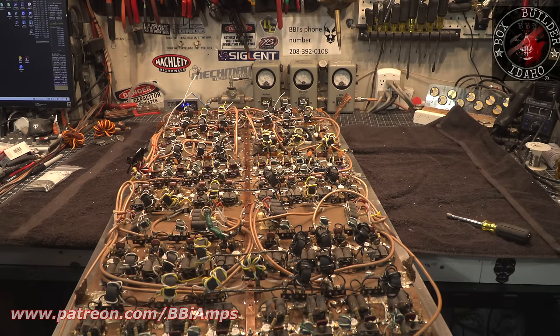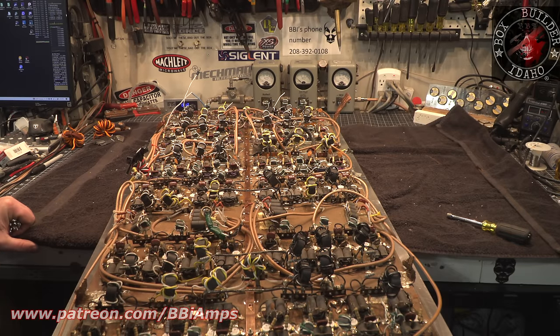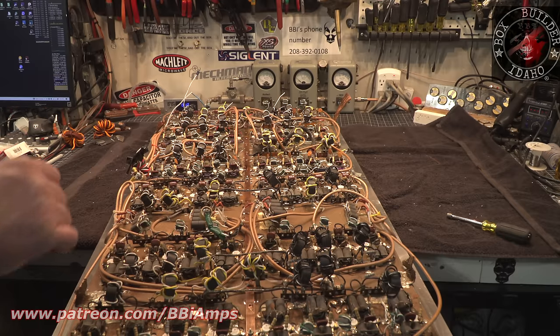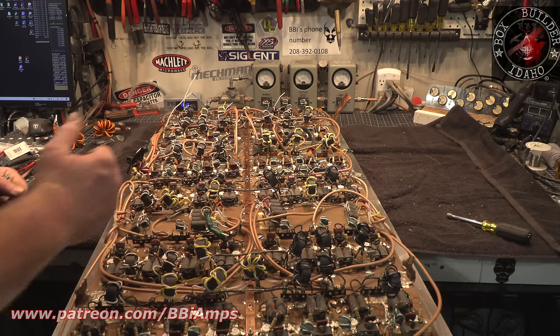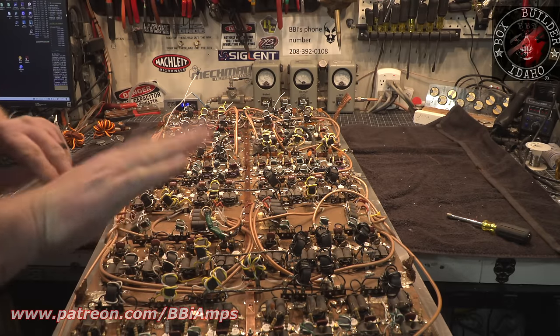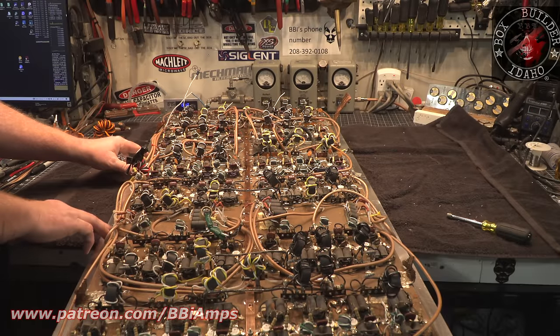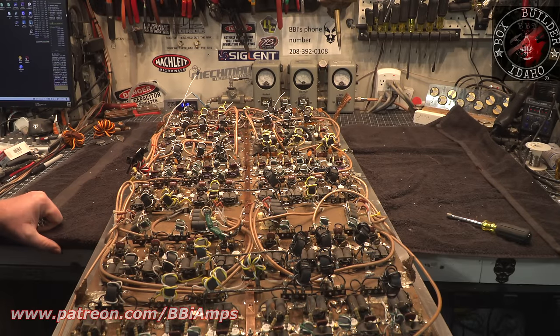Now you guys know that I've got this massive soldering iron collection, right? Well, then a thought came to me, well, instead of having all these wires running everywhere, why don't I build a custom copper bar that goes down the middle of this thing? I can bolt it down to the base plate for the amplifier and then solder the bar to the actual phenolic, and then we can lock this whole structure down. Then I could do the same thing going here down the T-section and make it so nothing can bow or flex or move. Now that we've got this physically bolted down, better than that sheet metal that was holding the thing together, right?